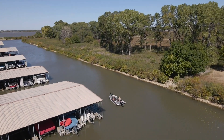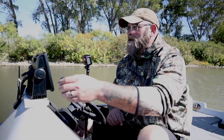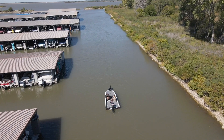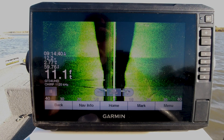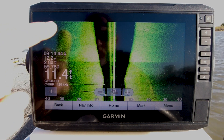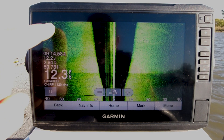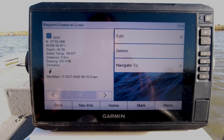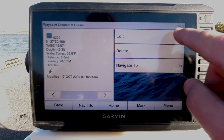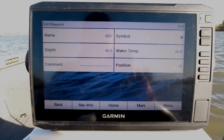Let's move on to tip number three — how we're going to set waypoints when we get to the areas we're looking for based on our depth using side imaging. We're making a nice run up along this rocky bank, so I can see underwater cover along this run. I want to set some waypoints to go back and take a closer look later. When you see something you want to mark — rock pile, brush pile, lay downs, whatever — the simple thing to do on a Garmin is a simple swipe down. Once I'm there, hit my waypoint button. There you go — new waypoint 222. You can go in and edit, change the name, make some notes, and it's going to tell you the water temperature and depth — everything you need to save it for later.